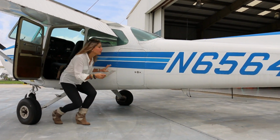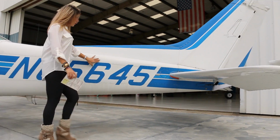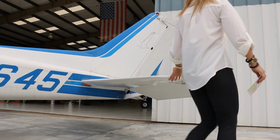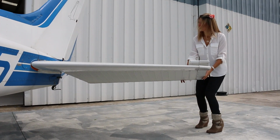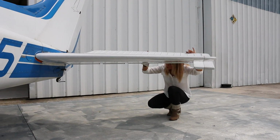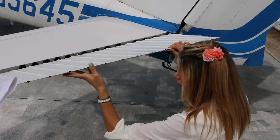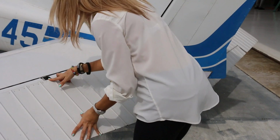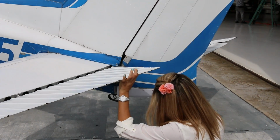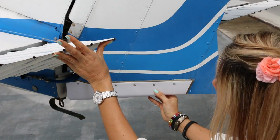As you move along the outside of the aircraft, always check the condition of doors, rivets, and antennas high and low. Carefully inspect the empennage, including the tail fin, horizontal stabilizer, static wicks, as well as elevator and rudder attachments. Look for damage, proper cotter pin connections, and of course, proper movement. Grip the strong parts and avoid bending adjustment tabs.